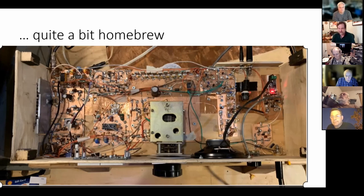There's Dishal software out there, where you plug these parameters in, tell it how wide you want the crystal filter, how many elements you're using, and it'll spit out a schematic saying, okay, build this. Then you build it, then you measure it, and it might be a little bit off. And then you start tweaking and you get it to where you want it.